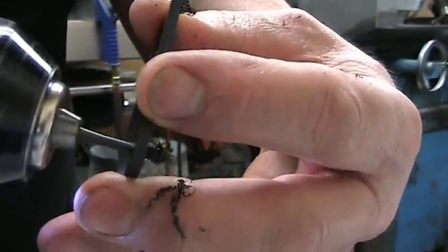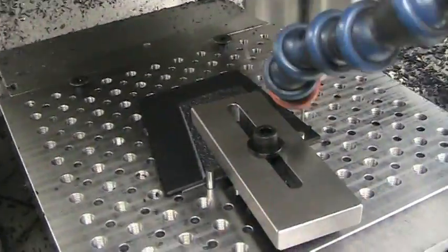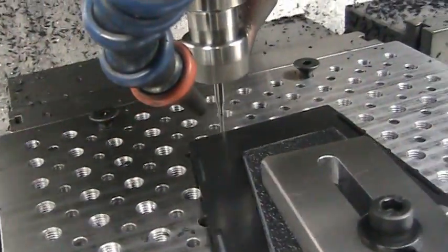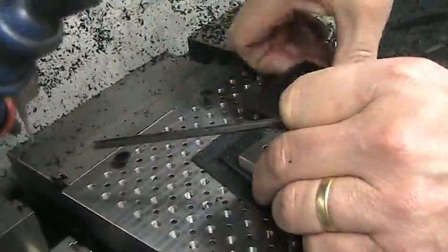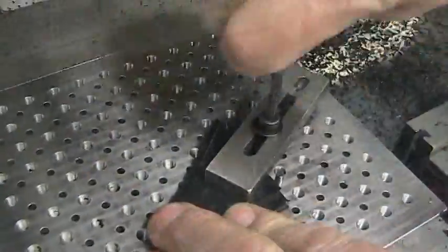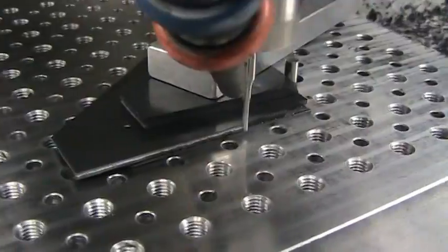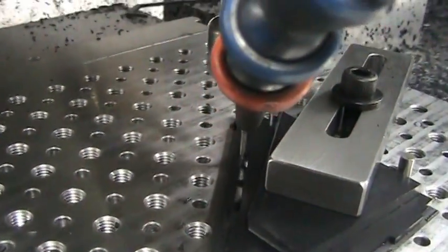Tapping the holes in the flange for the fan to screw to. This piece only needs three sides machined so it can be done with a single clamp — doing the slots first and then the periphery, and then it's complete. You can see how this fixture plate makes doing all these a lot easier by being able to just pick spots and clamp locations that allow you to get access to the piece.